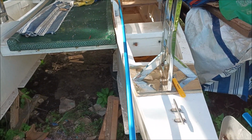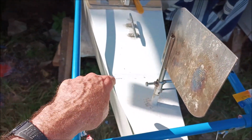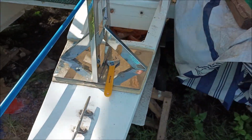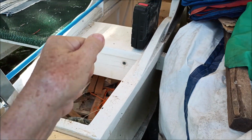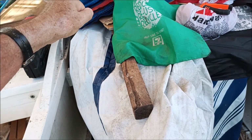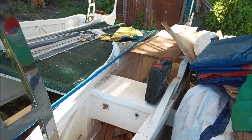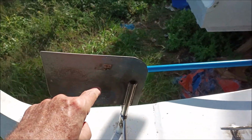They have like a bamboo pole there, and they connect it onto here. However, normally they have this here on this side here, so it's a direct connection from there to here. There's no U's and all this stuff that we made. Problem with that is the way that works is when you pull back. If you're on a motorcycle or a car and you pull back or you push your left hand down, you turn left. And when you raise your hand or push your hand forward on a motorcycle or car, you turn right. Well, in this, if you push it back and this arm is on this side, instead of turning left like a motorcycle or car would, you turn right. It turns the rudder, so the boat turns right.